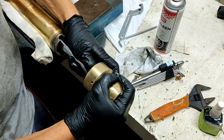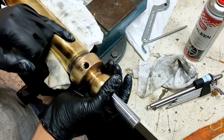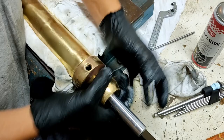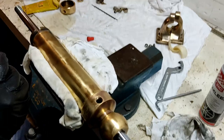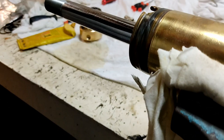I'm going to keep holes aligned here so that when I am trying to get the O-ring over its shoulders and all the rest of it, all I'm doing is a small wiggle movement. All right, gone past all the sharp things. Boom, it's on. The O-ring has now gone up the ramp and is in its final resting place. Do that again on this other end, well lubricated.